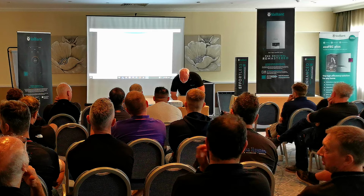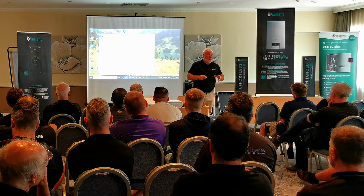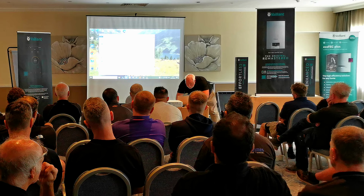That is a genuine situation. I think the house has been cavity filled. It's a 60s, 70s house. There's a drill pattern on the outside. So I think it's been insulated post-build, but it just shows you can fit it onto existing systems. I'm assuming that cylinder was heat pump ready, or it was getting satisfactory heat pump water from the system.